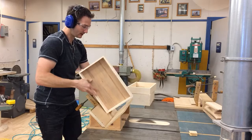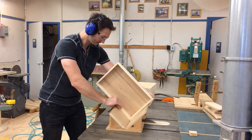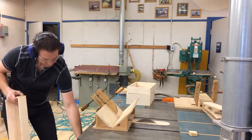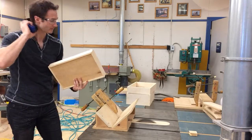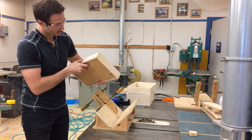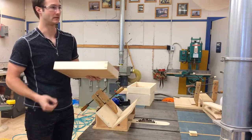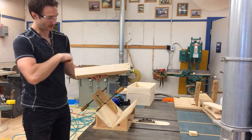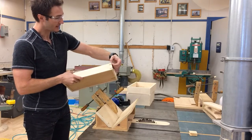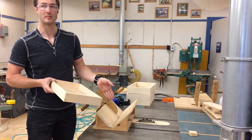Rotate it. So I'm cutting the same corner. I just pull it out, I cut the same corner, and now I have a symmetrical spline, top and bottom, and it's just nice and clean and tight. Jake's going to go around and do all the other ones. It's going to be exactly the same setup. And if he wants the same offset with his other drawers, he can continue doing all of his other drawers with the same setup as this.